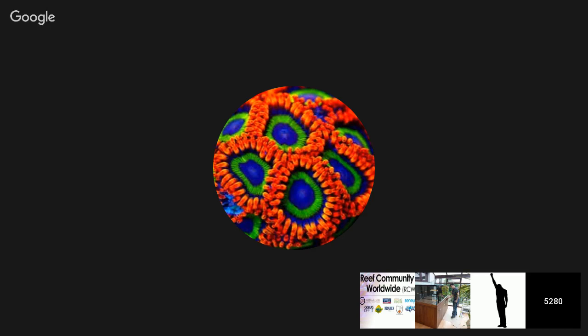As I was saying earlier, if you take just a metal halide bulb with no reflector and hang it and give it power, the light's just gonna go everywhere. Even if you have it sitting sideways and the top part is hitting the reflection and then going down, you're still losing some of the light from the bottom part going stray and seeping out the sides. But when you have the bulb facing downwards and the reflector all around it in a 360-degree manner, you're getting much better reflection and use and efficiency of your light.